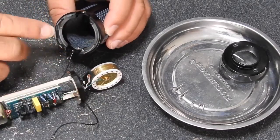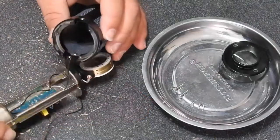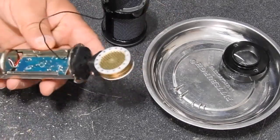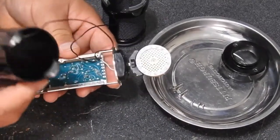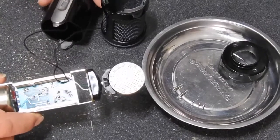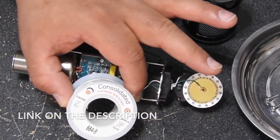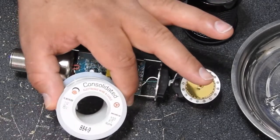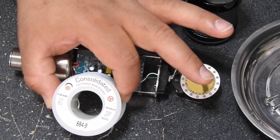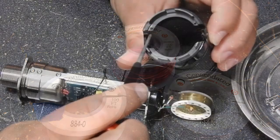I want to show you a picture of the soldering — it was actually soldered on the grill. I redid that one. The original wires were a little shorter, but I like to have them a little longer in case I need to do any work on the mic, so it's easier and I don't have to desolder them unless I really have to remove the whole board for major work. This is the wire I used — I'll put the link in the description. I bought white, red, and black — I use these wires when I do guitar pickups, effects pedals, electric basses, and similar work. It's very good wire.